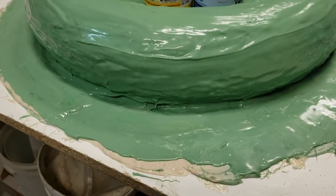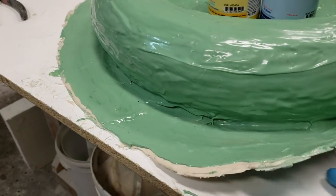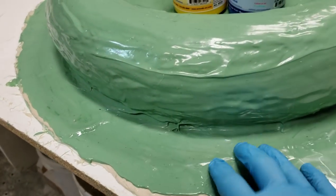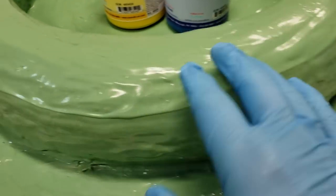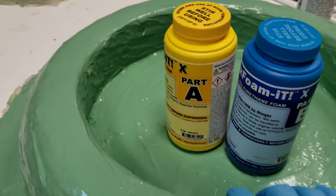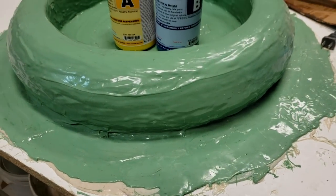They recommend four to six coats. I just did four coats, using color on every other coat. Four coats is plenty - you can see there's really good thickness on there, nice and meaty. But you can see there's going to be little drips and ridges - don't worry too much about that. Don't fiddle around and get too fussy because you don't have a lot of pot time, so just get it on and leave it.